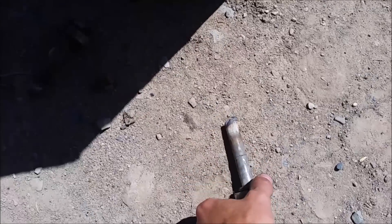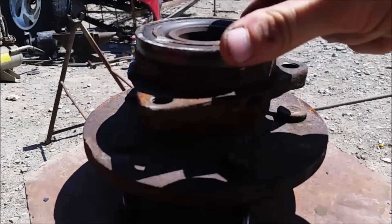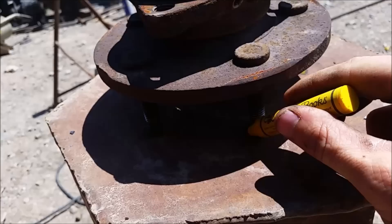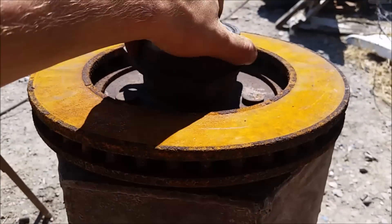I just got done cutting off the original bearings. They really couldn't handle the impact, so I've been marking it out to put on this bigger bearing here. This is actually a wheel bearing from a car, so it should be much better. I'm using this disc here as what I'm gonna be running the belt on, and then here's the bearing.